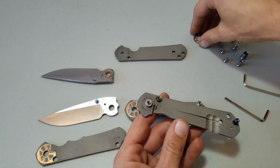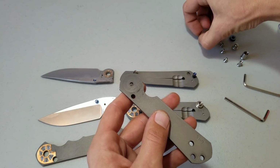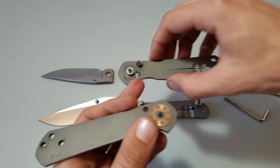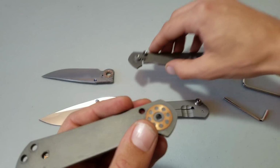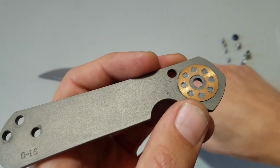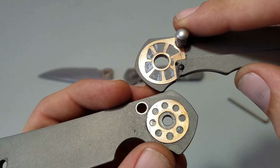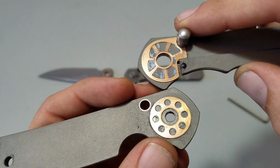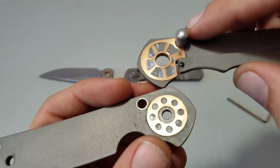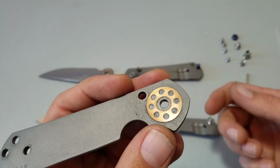I'm just going to leave that on there, okay? Here, I'm going to pull up this side. It's actually moving, okay? You can imagine you've got this bushing system here. The bushing system is holding this washer in place, right? And those are called grease pockets. The reason that there's holes in these blades is it does a couple things. It minimizes the friction because there's less surface area, less surface contact between the actual washer itself and the blade. And so there's less friction there, and it makes it smoother, easier to maneuver.